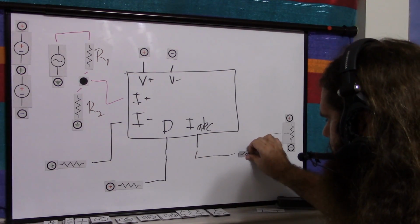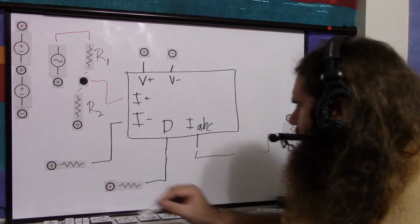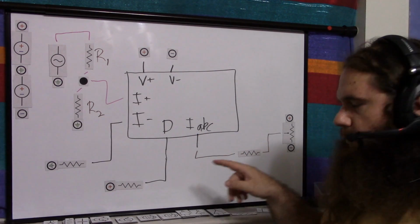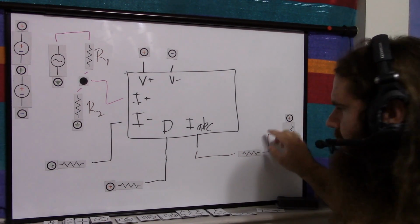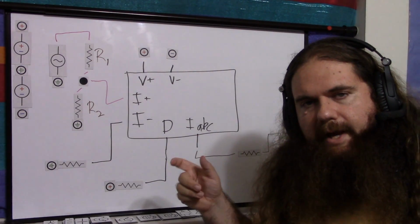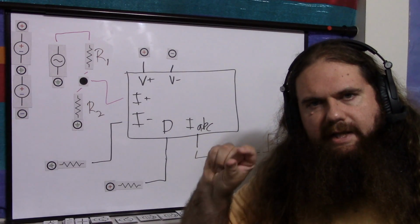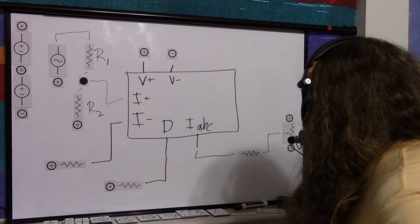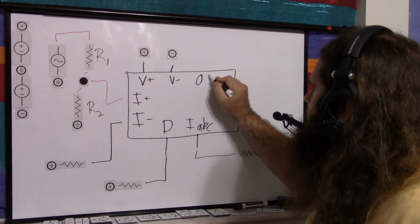And then once you get that correct value, you put in the fixed value resistor, and the potentiometer stays because that's your knob. Whatever voltage control you have here, the point is that you're getting the correct current in at maximum volume, and then you'll just have less current as you turn the volume down. So far, fairly straightforward. There's one more pin. Obviously, that's out. There's your output.